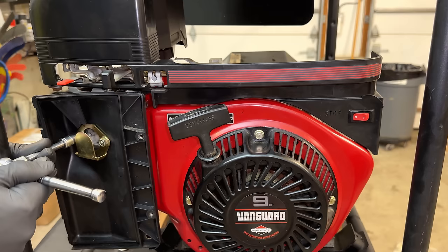Now this time I'm only going to use the amp probe to measure the THD. The button that switches between voltage and Hertz, it's sometimes not working. So I'm not sure if it's due to the cold, being that it's about -7 Celsius or 19 Fahrenheit, but whatever the reason, we'll just leave that alone, check the THD, and we'll use the kilowatt meter to check the voltage and the Hertz, and of course the oscilloscope to see what that waveform looks like. So let's get it started and see how this one does.